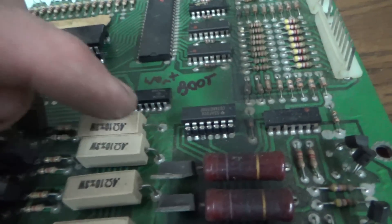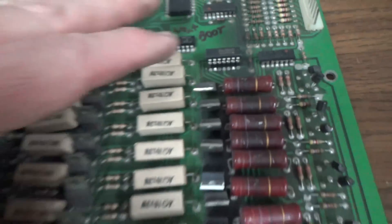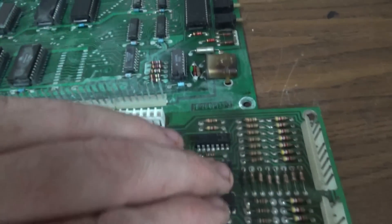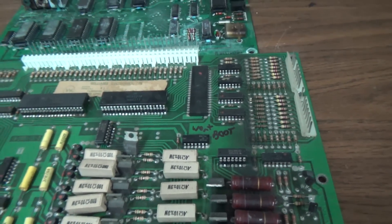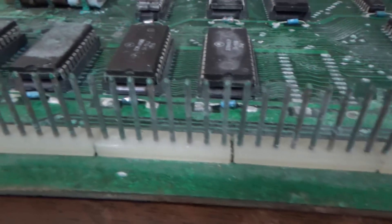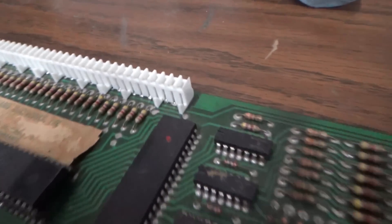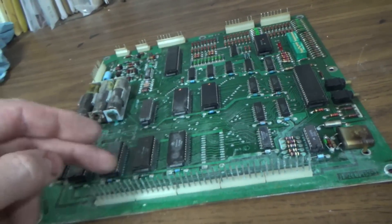Here is the crystal for the board. You can see the heat damage on it — it's probably still fine. The reason it's like that is because this is not the same board that was in the game — the one that was in the game is missing. They have this issue where they have these big old power resistors here for the lamps, and these things get hot. These look like they're all screwed up but they're not — it's typical for these older Williams games. You can see how it scorched this board. The crystal was probably much worse on the original board.